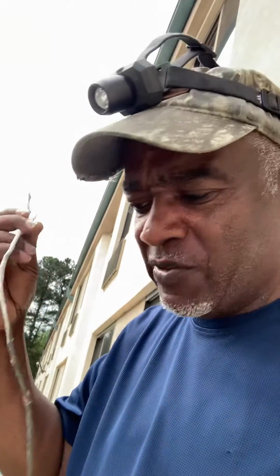So always make sure you check your low voltage wires. Just ohm them out to make sure they're not touching anything. That's a whole lot easier to fix than going up to the parts house and getting parts all the time. Some people think it's a defrost relay that's bad, defrost control that's bad, or even a stuck contactor. That's not always the case. Just start ohming out wires before you decide to change parts.